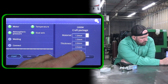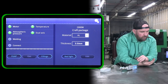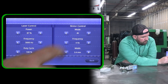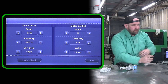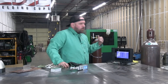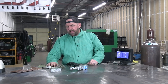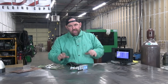So we've got eighth inch material for this test. We have 3.0 and 3.5 — we're going to go 3.5. Eighth inch is technically like 3.2–3.3 millimeters, so we'll go 3.5. Going back to the edit page, you can see it's changed everything in the menu for us. We're at 87% power now. Instead of the triangle, we're now running the D shape, and we've gone down on our frequency while our scan width has increased. We still have our wire feeder to set up — right now we're running .045 4943 aluminum wire set to 80 centimeters a minute feed speed.